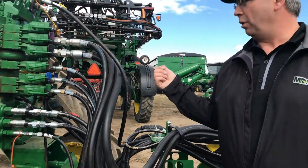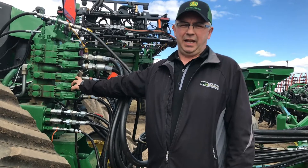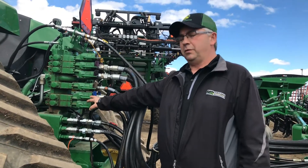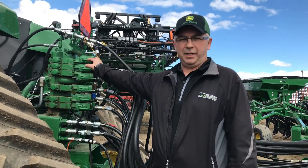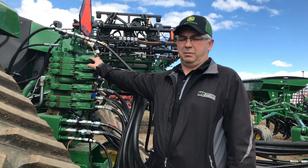In the interim tier 4, I should explain, those pumps are 78 gallons total. Our bottom set is running on 48 gallons per minute on the front pump, and the top is running at 30 gallons per minute on the back pump.